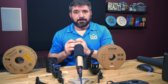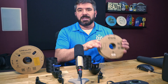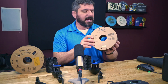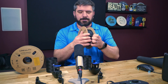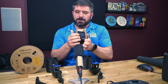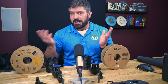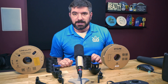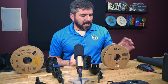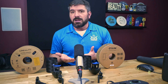Coming to reliability: I did not have any issues printing from my Creality Hyper Series roll. I did have some issues with my eSun roll — the filament got stuck; it wasn't tangled, but it actually started to pull apart the spool. You can see it's starting to come apart super easy. I could not figure out why the print failed, because I was not monitoring it.